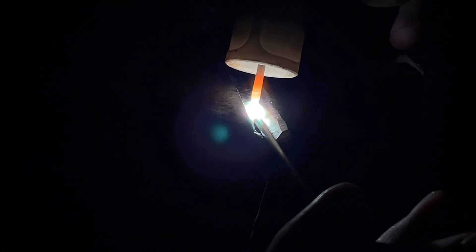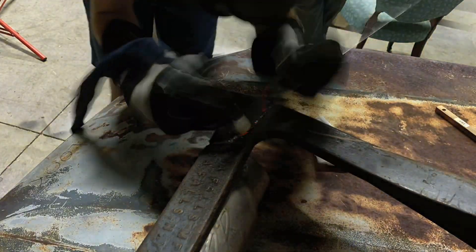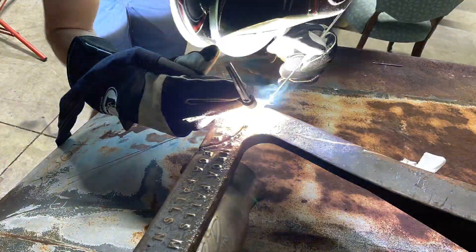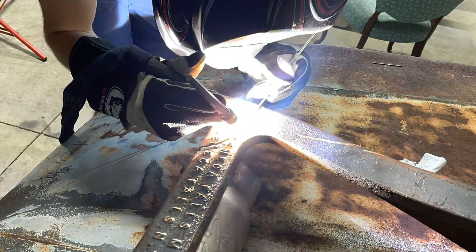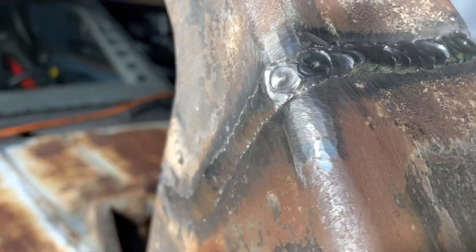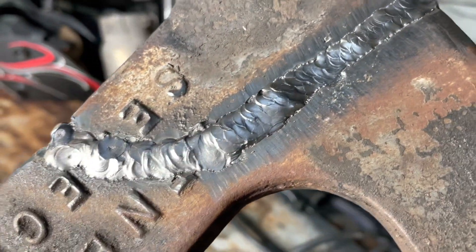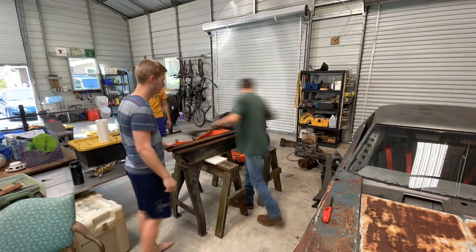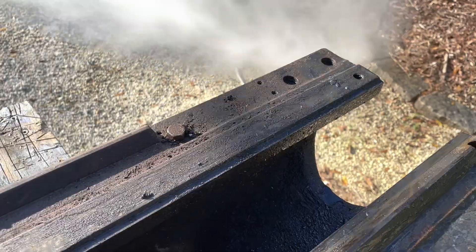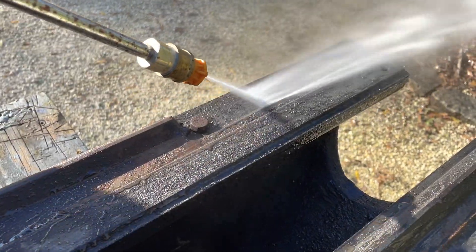The 99 nickel wire worked really well. We laid it down in the crack and welded over it. The person who did all the welding is my brother — I'll link his Instagram in the description. This took loads of wire and nickel is not easy to weld at all. He did his best and it came out looking pretty good. None of us are professionals, but I think it looks great for a first time welding cast iron.